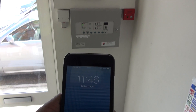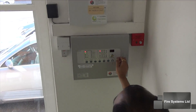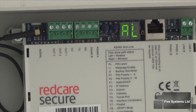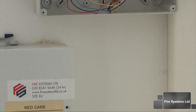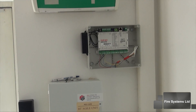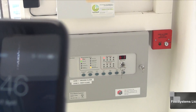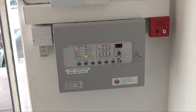The following test will be recorded at 11:46, but this time it will be a fire alarm activation and not a fault. You will now observe that on the digital display the alarm indication is now followed by 01 as opposed to 02. 01 is the number for fire alarm activation. The fire alarm system has gone back into a fire alarm condition as there is still smoke detector test gas within the chamber of the detector. This second alarm will also be recorded in the event log.